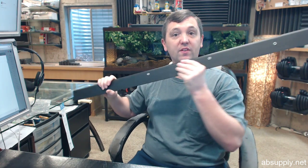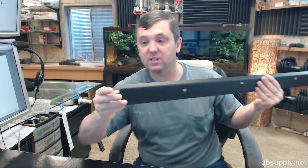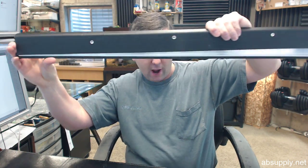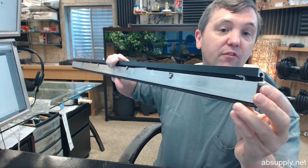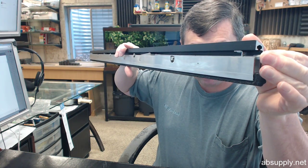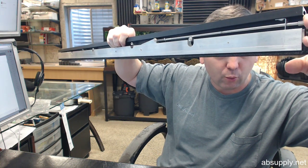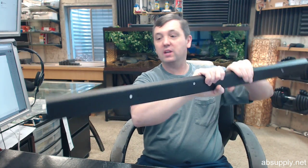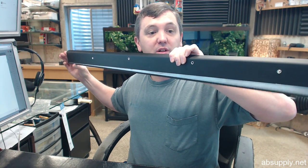When this is mounted to the face of the door and the door is open, the plunger — being spring loaded — is fully extended. When the door closes, the plunger comes in contact with the face of the stop; as you continue to push the door closed, the plunger is depressed forcing the bottom to drop. That is how an automatic door bottom works. From the back side, when the bar is pushed in it compresses a spring inside. It's normal that it will drop unevenly — that is typical behavior.